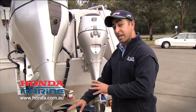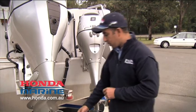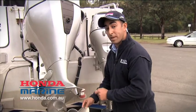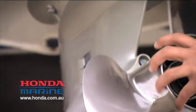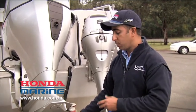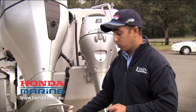We should also check and maintain our propeller as part of our regular maintenance schedule. Spin the propeller and take a look — make sure the blades are all nice and even, make sure the blades aren't folded over or bent, and that there are no major dents, chips, deep gouges, or scratches. Any of those may introduce vibration, decrease operating efficiency, and increase fuel consumption, which will cost you more at the end of the day.